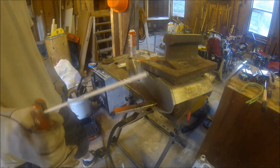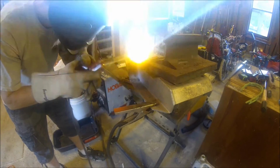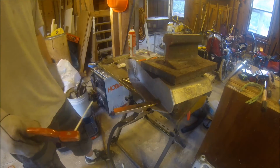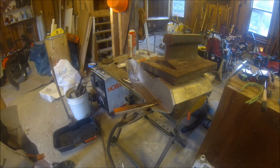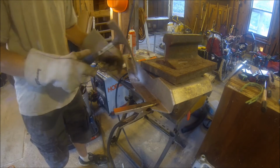Now when the end gets covered with flux, I just drag it on the concrete floor. And that's what, 1.5 inches, 2 inches of bead, and I've already used more than half the electrode, which makes stick welding aluminum pretty expensive compared to other rod. Horizontal only, because as you can see, slag runs downhill like water.